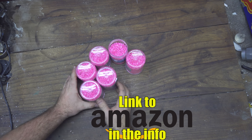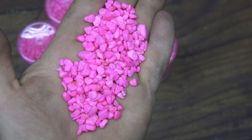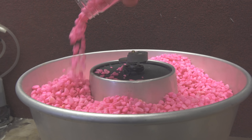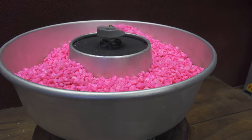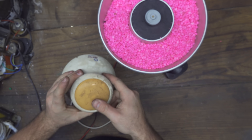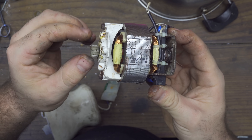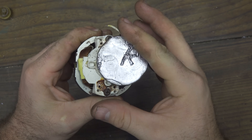I now have these six containers filled with quartz stone. This stone is pretty hard so it works like an abrasive — a very good choice for removing rust from metal. You can also use it to polish wood parts or anything else. I fill the container halfway and turn on the motor, but unfortunately nothing is happening. Probably the motor is too small or maybe I put too much stone. I want to replace the motor with a much bigger one — this old kitchen mixer that cuts fruit or vegetables works great. Inside we have a much bigger motor, and I replace the plastic gear with a much bigger lead circle which is heavier and unbalanced, so it will also create a lot of vibration.